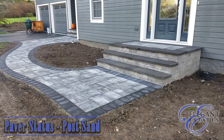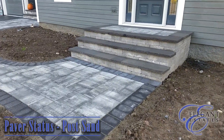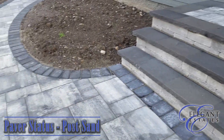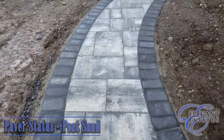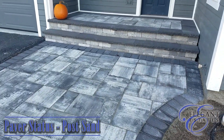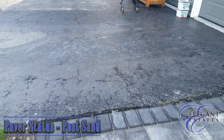It's been a little while since we've done an update video. The front here is done — all the cutting, setting, sanding, the stoop work is done, and lighting's done. We did go with the resin sand, so it is a semi-permeable joint. That makes it that way because the sand is permeable, and the paver is not technically permeable since it is labeled a standard paver, but the water does actually permeate down through.